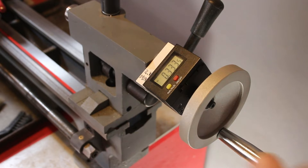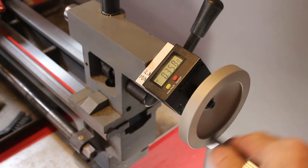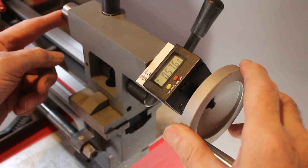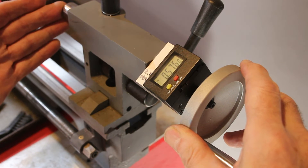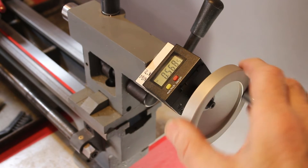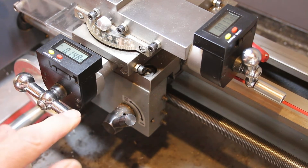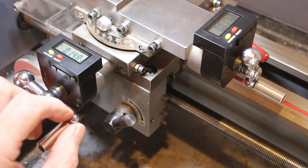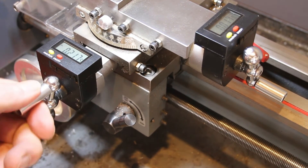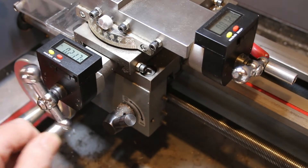This is the digital readout on the tail stock. I've mounted it at an angle here because it's just easier to see — originally it was horizontal and I really couldn't see it while working, so I twisted it around. One of the nice things about all these DROs is they measure the actual position of what's moving — the quill or the cross slide tables — so no matter how much slop you may have in your system it doesn't matter, because it's measuring the actual position and not your hand wheel position. Another thing I did as one of my first machining projects was to improve the handles here, because they had no swivel on them originally. This is just a piece of aluminum rod and a cap head screw — very easy to make, a great first lathe project.